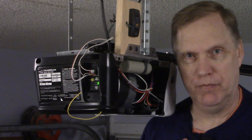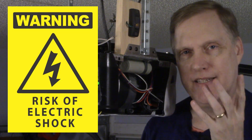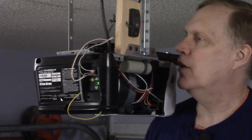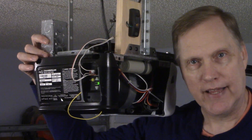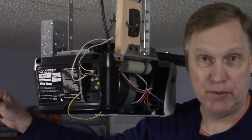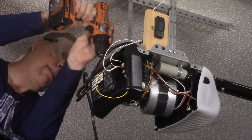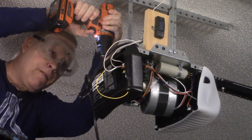I've removed the access panel from the garage door opener and unplugged it so I won't shock myself. The idea is we're going to draw power from the motor that runs the garage door opener and run to this junction box, which is going to mount right up here, so that we can plug that cable in. That way, if we ever have to take the garage door opener down, we can disconnect the house just by unplugging that one cable. First thing to do is drill a couple of holes to mount the junction box to the metal top of the garage door opener, taking care to stay away from wires and chains.